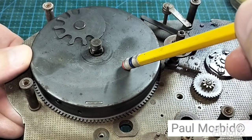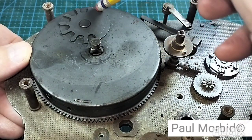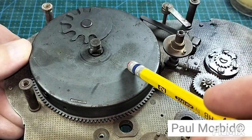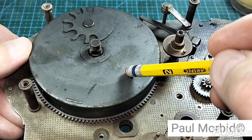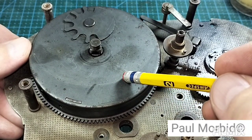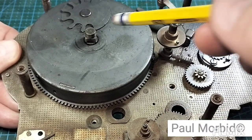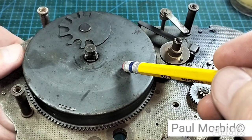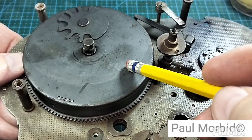It's going to unwind and chip some of these teeth, is what it's going to do right here. Even though you have fully unwound the camera, and that's another thing, you have to fully wind down these motors before dismantling the cameras. Otherwise, it will unwind and snap to a stop. It's going to damage some of your other gears here, potentially. It'll definitely damage the motor, and then you get a real problem.